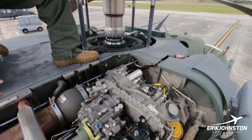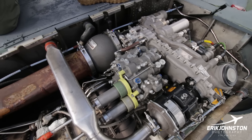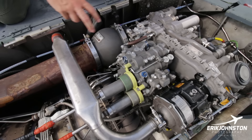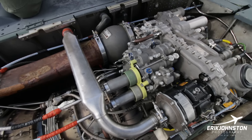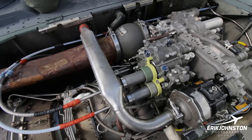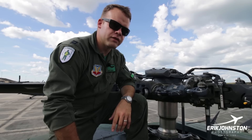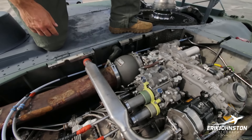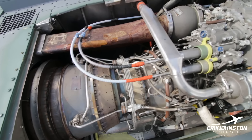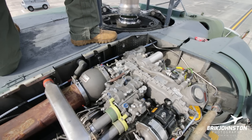We've got the accessory drive here with different sensors attached to it. This is the inlet particle separator — when air comes into the engine, it's got this blower motor that's almost like a turbocharger, except instead of blowing it into the engine, it sucks out any dust, particulates, and stuff, and blows it out the back of the aircraft so it doesn't go into the engine. Some older helicopters like the Huey have swirl tubes that act almost like an air filter, whereas this is a more active system. We've also got the hot section here, the accessory drive, and the gas-generating section under here with the fuel control on top.